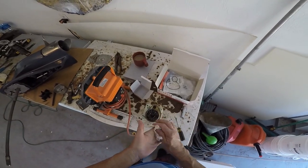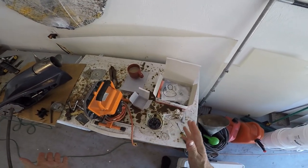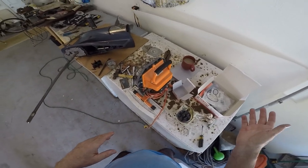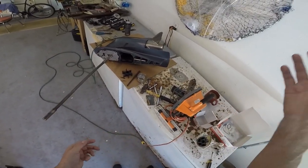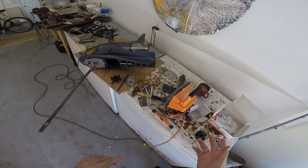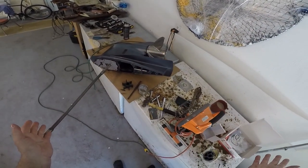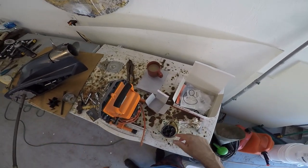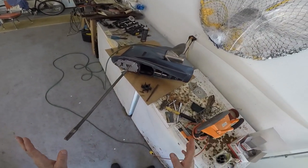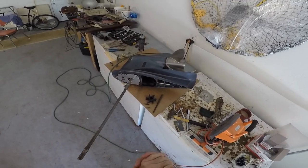The old one had a little over 300 hours on it. I got the boat with 250 hours — I checked the water pump, it looked good, but the person I bought it from didn't know when it was last changed. At the 100-hour service you check the pump; at 200 hours you change it. It probably was never changed. Don't go any more than what they recommend on these pumps — they're very critical. Luckily I caught it in time, nothing overheated, I was close to the dock and got back with the trolling motor so there's no damage.